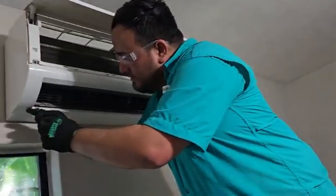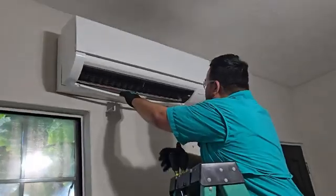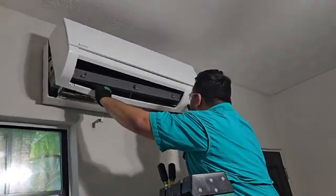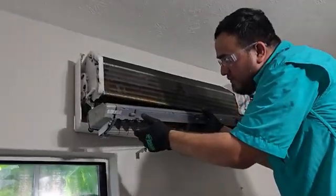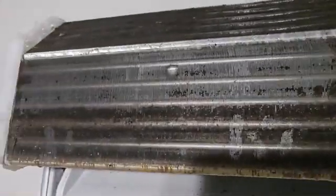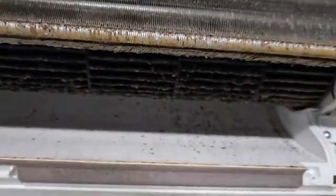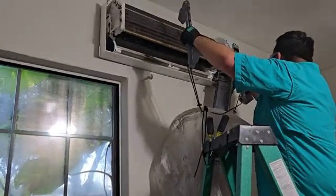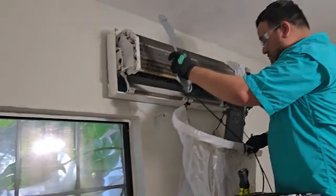You can see screw one, two, and then the third screw right here. After that, we pop it from the bottom, push it up, and remove that panel. Then we remove the drain pan from the bottom of the system — it has a few clips, so you'll leave it hanging. And look at this — this is the before. Look at how that blower wheel has all that dirt, all that debris, all that gunk and mold. We're going to remove all that, and I'll show you how it looks when we're finished.